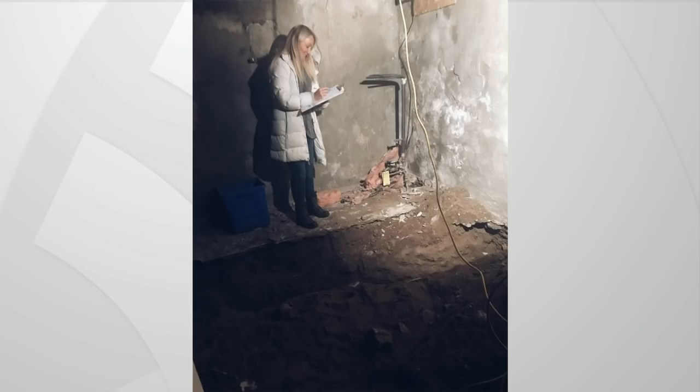We've dug up around the water meter in the basement and you can see how thin that basement floor is. In new construction we put gravel down and have nice thick concrete floors, which produces a drier, warmer floor with better drainage. In my situation that floor broke up with a shovel — not even a jackhammer. So this is an opportunity to do the floor properly.